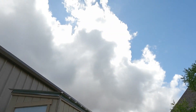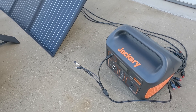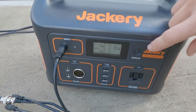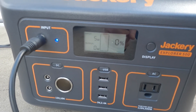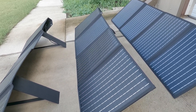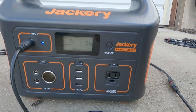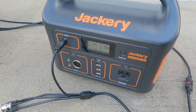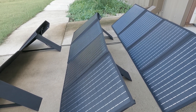I got the solar panel set up. It is a mostly cloudy day — the sun is currently behind the clouds. These solar panels aren't even pointed at the sun. My Jackery is completely bone dead, zero percent, so I'll have plenty of time to experiment. It is sucking in five watts — almost no sun, and we're still able to pull five watts, which is very minimal. It would take 100 hours to recharge this 500 watt-hour battery with just five watts. That shows you how much sun is really necessary for solar panels to be effective.